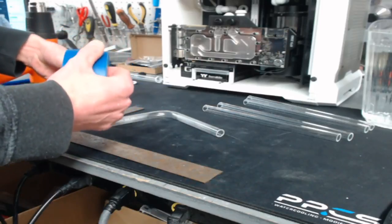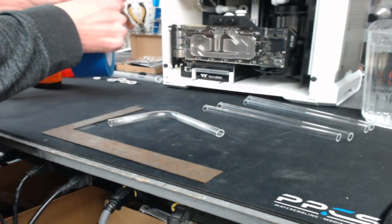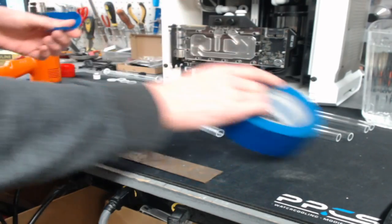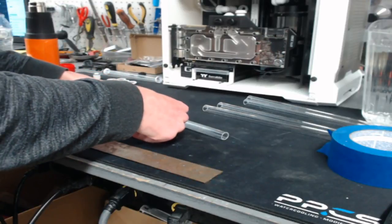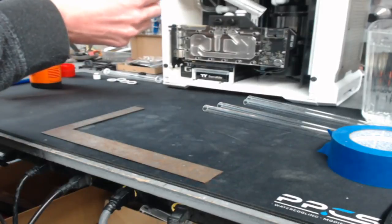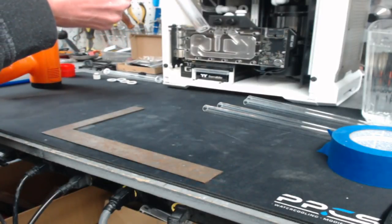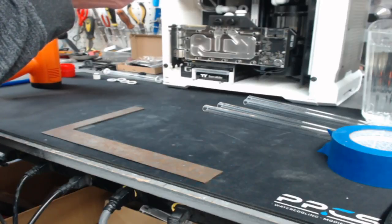So for cutting this tube, one thing that I would recommend trying out, I do use a scroll saw here to actually cut it. However, if you're using a regular hacksaw too, this could maybe even help you. It will help hold the tube into the hacksaw a little better. I mean, I could demo using the hacksaw if you guys really care. Otherwise, I might just bust out the scroll saw.